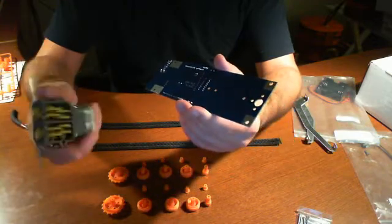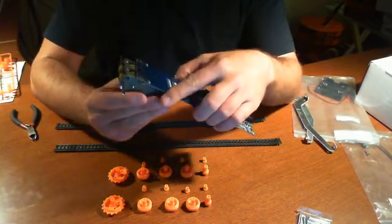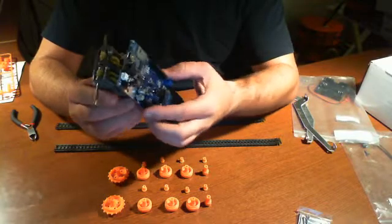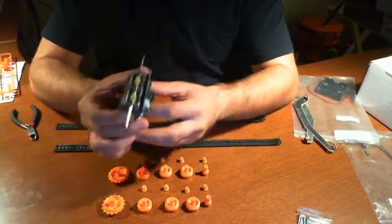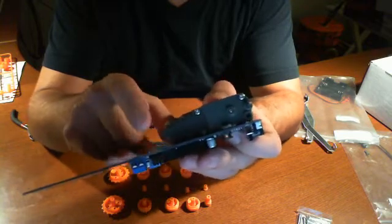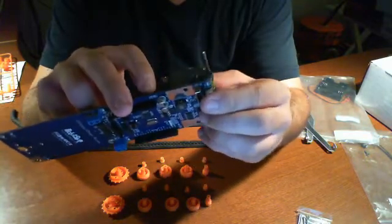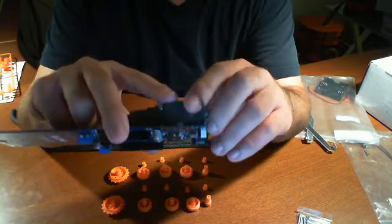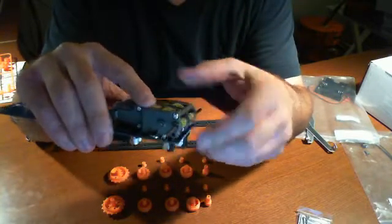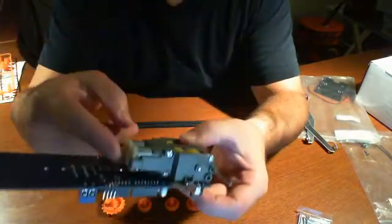What happens is that we're going to have to mount this flush to this unit. So if we mount this back here, this is going to stick out in the back — it's going to be slightly off, it's not going to work right. So we have to mount it back here. The important thing to note: there is absolutely very little or no clearance between the motor and the actual controller. I would recommend putting in some spacers, although I'm not sure if we can, to give this an extra rise. Also, some of the soldering points sticking out from the bottom actually keep this from being flush, so be careful when you're mounting this. Make sure nothing is touching any of the contacts on the actual motors themselves.